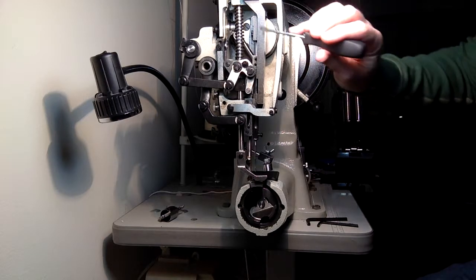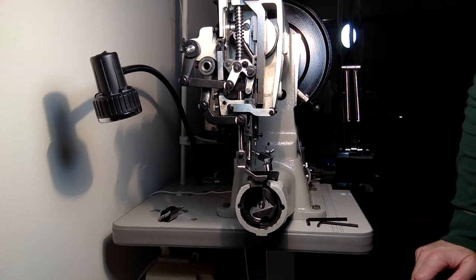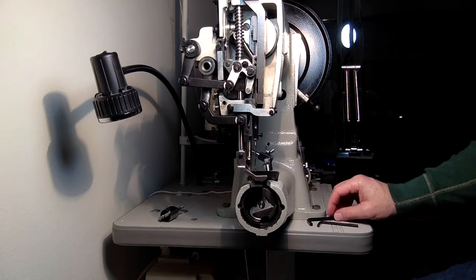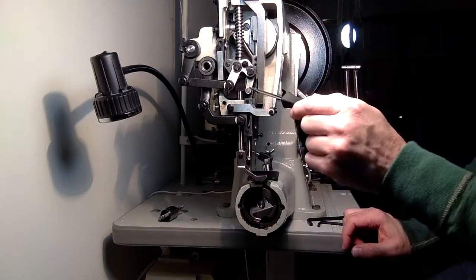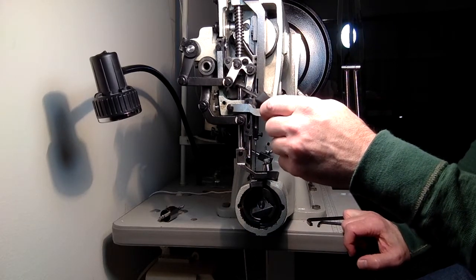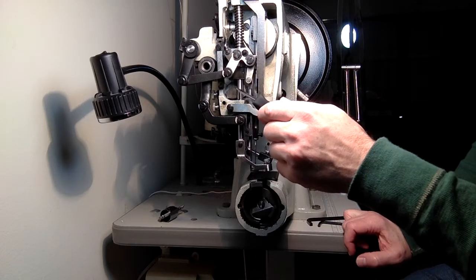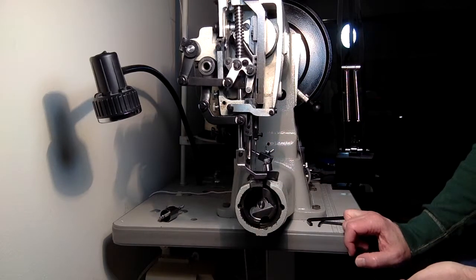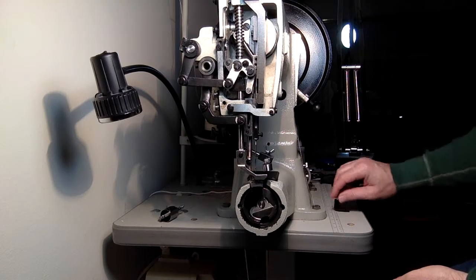Somebody had suggested that this shaft was binding somehow because it was bent. I don't know if that's happening or not. There's a block on the bottom underneath this support block for the spring. This block is attached to the lifting mechanism, and that's what, when you step on it, tends to release the binding from the upper section.